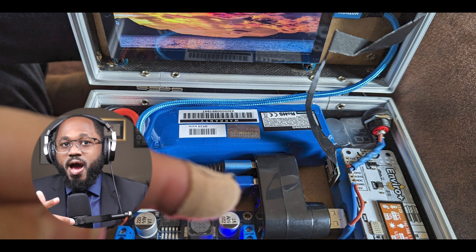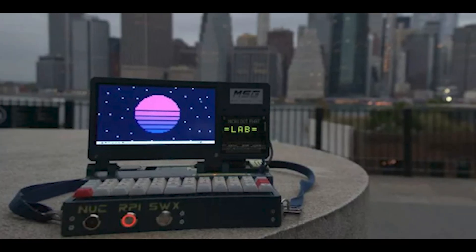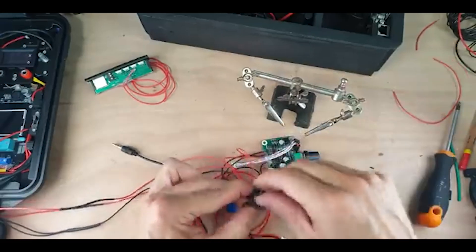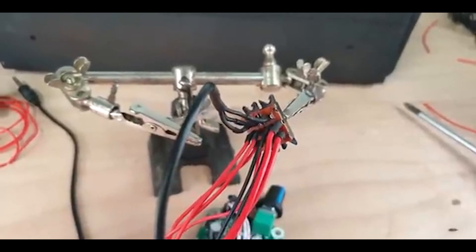So what are some creative ways to power a cyber deck on the go? You can use USB Power Delivery PD power banks — these can provide up to 100W of power via USB-C, making them suitable for powering more demanding cyber decks. You can use USB PD modules to request specific power profiles and then use DC-DC converters to generate the required voltages for your components.